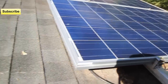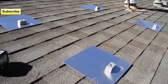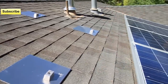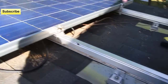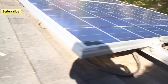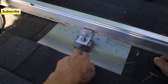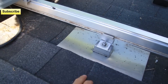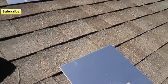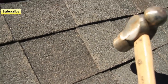So we're on top of the roof now. I laid out the four roof penetrations — that's their tentative location. Now I just got to find the roof rafters. Since I've already done this on the previous install, I know a rafter is right here, and there's another rafter 24 inches away from this one. You can measure, and you can also do the hammer test.